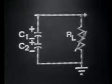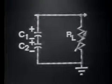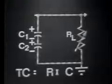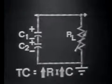If we isolate C1, C2, and RL from the diodes, the discharge path for C1 and C2 is through each other and the load. Since it takes time to discharge the capacitors, and since the time constant equals resistance times capacitance, or R times C, the higher the value of resistance and capacitance, the longer the time for one time constant. With a long time constant where resistance is high, average output voltage is high. If the load increases, resistance decreases, shortening the time constant. This allows C1 and C2 to discharge a greater amount between cycles, so average output voltage decreases.